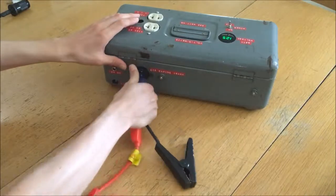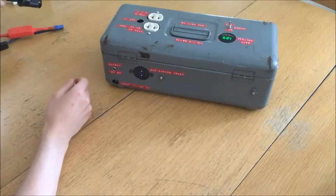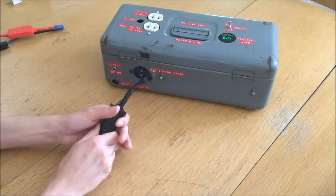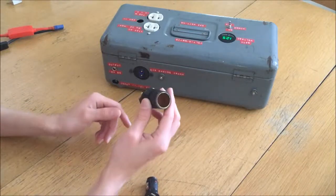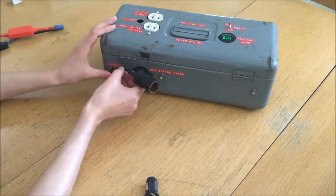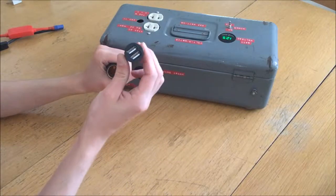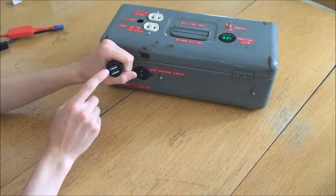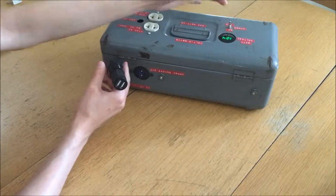In addition to the engine crank plug, I also have the 12-volt DC output. I've made a little adapter that fits inside the storage area of the toolbox with an accessory plug connector for a car. You plug it in and it gives you 12 volts. I can also insert a USB power adapter and get USB power out regardless of whether the inverter is on or off.